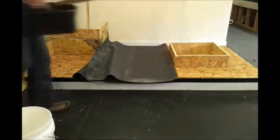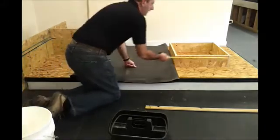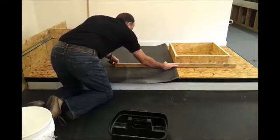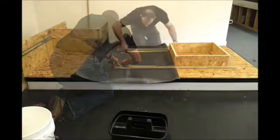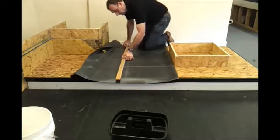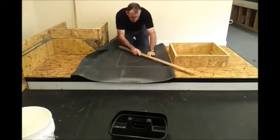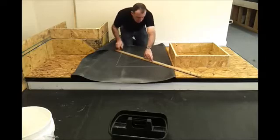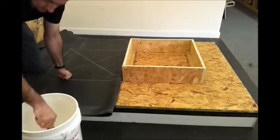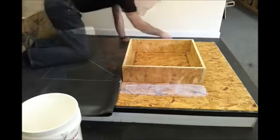The next thing to do is cut around the skylight protrusion just to the right. The contractor needs to make some measurements to see how big the skylight opening is and make the exact markings the same size on the back of the sheet. Just before we cut through the membrane, we apply some water-based adhesive to the sides adjacent to the skylight upstands in all directions.